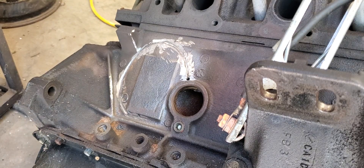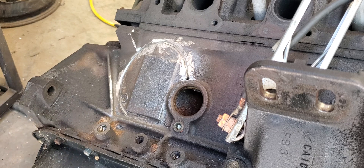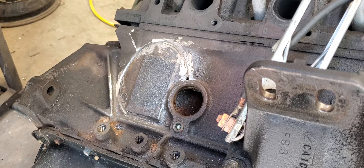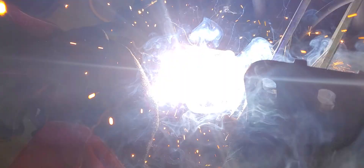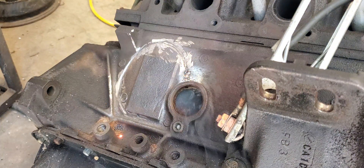Alright guys, we're gonna give this a try. Lincoln has A, B, C, and D for heat regulation on this welder and I've got it set on B, which is low to medium. The wire speed I've got set on low — about four out of ten. Right now I'm just kind of guesstimating to see if this will puddle up and even start working, so let's see where this takes us.